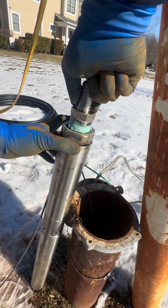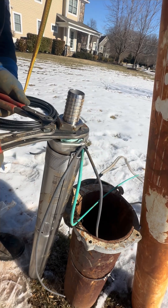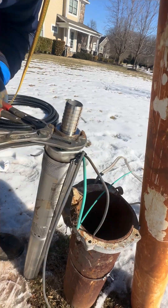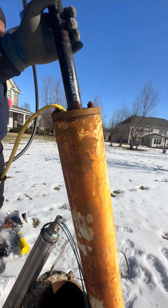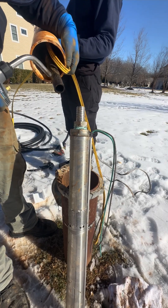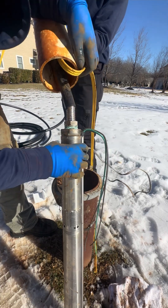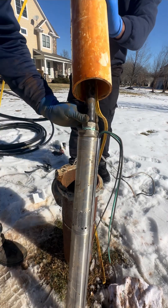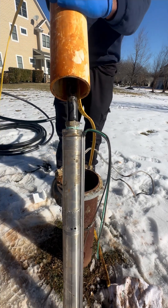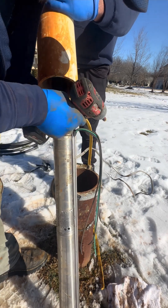This is going in the well, so we're gonna dope the crap out of this. This is the barb fitting we're gonna put up top — get it nice and tight because that's the only thing the pipe holds on to. We're gonna shove the water line through, heat this up so we can slide it right over that barb fitting, and then add some hose clamps so it clamps down over that barb fitting and it's not going anywhere.